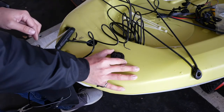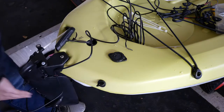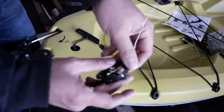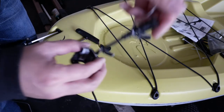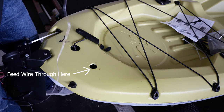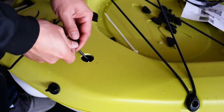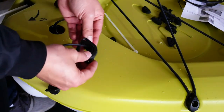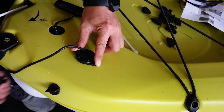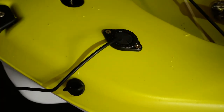Once aligned, use a 1/16-inch drill bit and drill a pilot hole on each side of the housing using the housing mounting holes as guides. Use a long thin wire, secure it around the transducer wire, and feed the thin wire and transducer wire through the housing, through the one-inch hole you created at the tail end of the kayak, all the way through to the front of the kayak. Take your grommet A and grommet F and insert them into the housing. You can now use the included screws in the in-hull wiring kit and screw them through the pilot holes to secure the housing to the kayak.